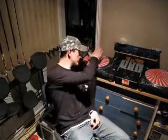You have got to take the plastic cover off from under the platter, so make sure you unplug it before you do it. I'm going to warn you now about unplugging it. And it's quite simple to do, really, so anyone can really do it, and it should help you out if you want a wider pitch range. So I'm going to quickly move the camera and I'll show you what to do.